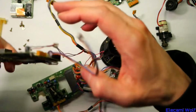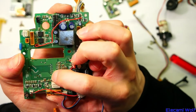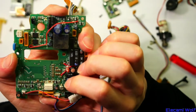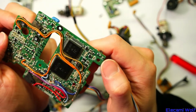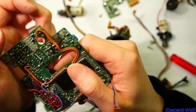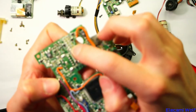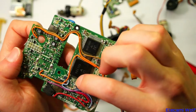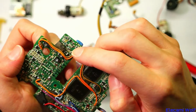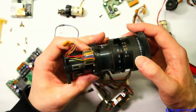Yeah, it's a different type of through-hole plating though. You can see it's got a white ring of stuff around it. So that's some kind of protection thing. Some of them don't have it. Maybe that's how they tinted it back then with different stuff, just the top overlay stuff rather than the solder mask. And I thought it was interesting that they're putting the silkscreen between the legs of devices, I think to help avoid solder bridges from the wave or dip soldering, whatever they do to these. Alright, I think we looked at enough stuff in this.